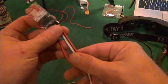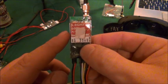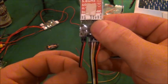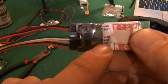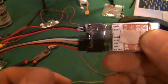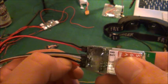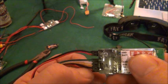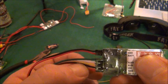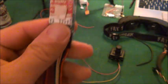Now we go to the video transmitter. These can look confusing but they're really not that bad. On the Immersion 600 we have power going into the transmitter. You can read the label — it says audio left, audio right, video, ground, and 5 volts out. That 5-volt out is for a 5-volt camera, which we're not going to use because our camera runs on 12 volts. We're going to use the main power to power our camera as well, and use the video and ground connections. The audio we're not going to use at all — just video for this quick setup.